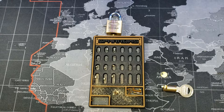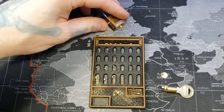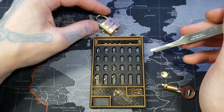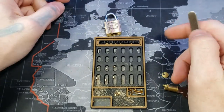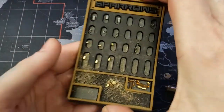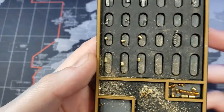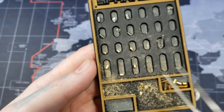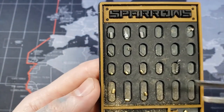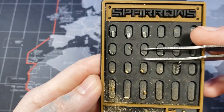We're back home. We have this gutted, and I made this into a little practice lock. I tapped all the sides and put grub screws in it — that way it's now guttable. Because heck, I had a second one of these, why not? And as we can see, it's all standard pin. So here are the key pins, here are the driver pins — all standard pin. And look how tiny these springs are — they are super tiny.